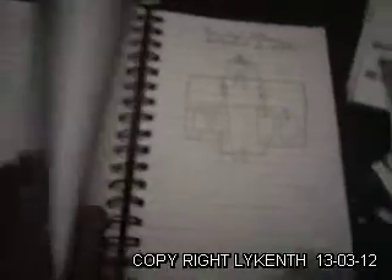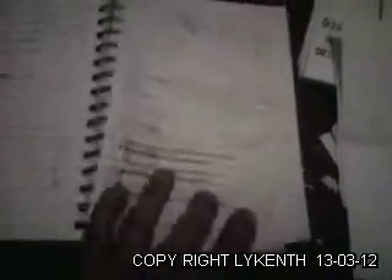I'm looking at my silver book — this is how scatterbrain I am. I've found... there it is. Here's a good example. That there, with a single diode, regulates AC — or rectifies AC. That's it. One single part and two capacitors. A rectifier has four diodes in it, which have voltage loss and heat conversion. With this, there's only one diode.